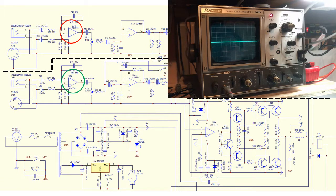Here we are back at the scope. Let's start by checking channel 2's first operational amplifier, op-amp U3B — its output is pin 7. There's pin 7 for channel 2. Now let's check channel 1 of the same op-amp, which is pin 8. They look identical. Let's move on to the next set — same op-amp chip, two different outputs. Channel 2's output is pin 1, and channel 1's is pin 14. Again, they look identical. So we can rule out this entire op-amp U3.